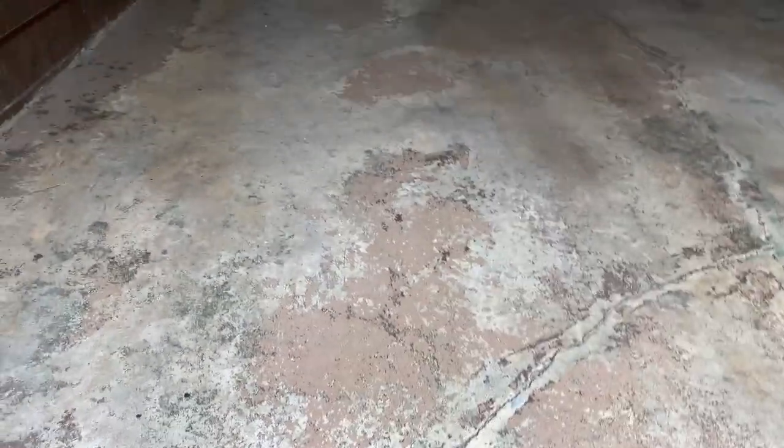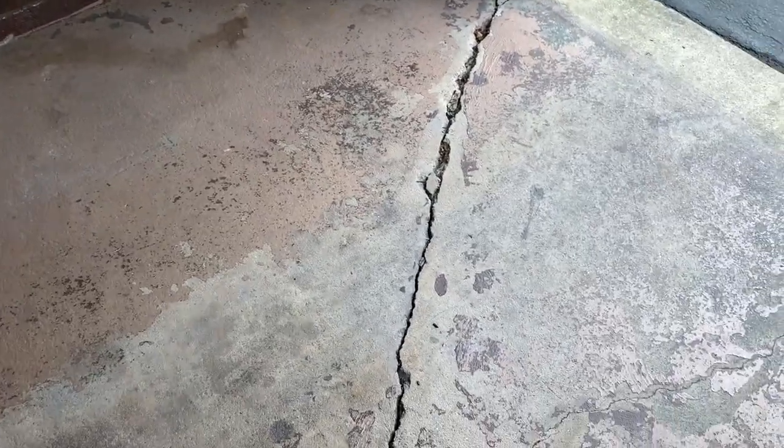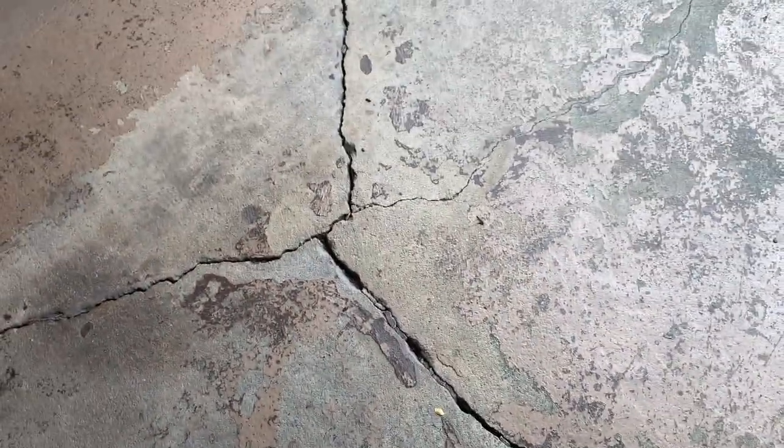So this is about 400 square feet and change. There are some extensive cracks in this floor. Now, this is important — make sure you tell a homeowner, if you're a contractor, that these cracks may reoccur. We're going to try our best to glue these back together using the CFS 343. We're going to grind this floor, shot blast these cracks open so they're clean, fill them with the 343, grind over them again, and then apply our flooring system on top. We're kind of fighting the weather today — I'll show a Doppler clip of what we have coming, and I'll show you how we hang the plastic to get around that.